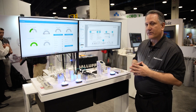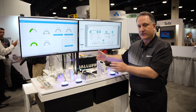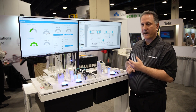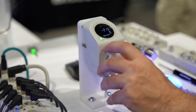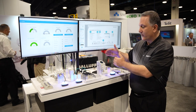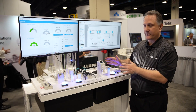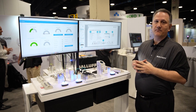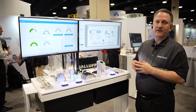There are a variety of application opportunities. I'm going to talk a little bit about the digital position indicator. Here we have a rotary position sensor, and all of these devices are IO-link, so you have the ability to dynamically change parameters. The digital position indicator works really great on hand cranks. It has a digital display showing the operator the direction to turn, what the set value currently is, and what the target value is, helping to guide the operator to change the hand crank into the correct position. As you can see, we have a very complete line of the Smart Automation and Monitoring System, or SAMS, for IP69K applications, with additional functionality with condition monitoring and smart features.